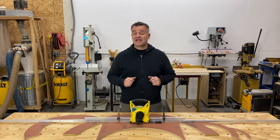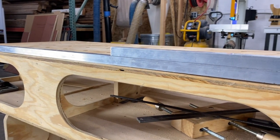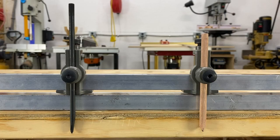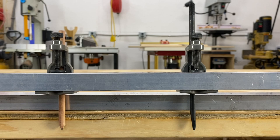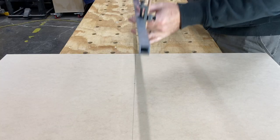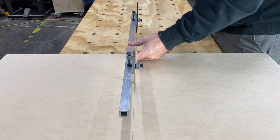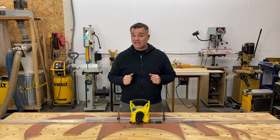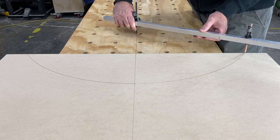Next step is to draw the arch. I like to use a three-quarter inch aluminum square tube — you can get this in multiple lengths; here's an 8-foot one and a 3-foot one. Next are the trammel points — both come with a metal point; I just replaced one point with a pencil. To draw the arch, it's as simple as setting the radius on your compass, placing your pencil on the top of the arch and the point on the reference line, then making a mark on the reference line where the point touches. Now draw your arch — it's that simple.